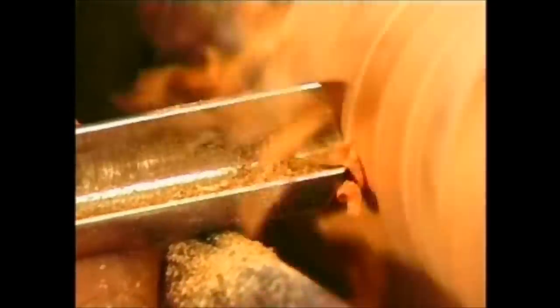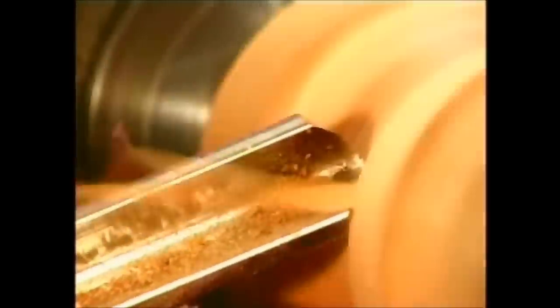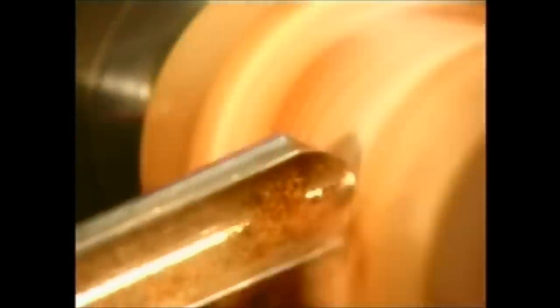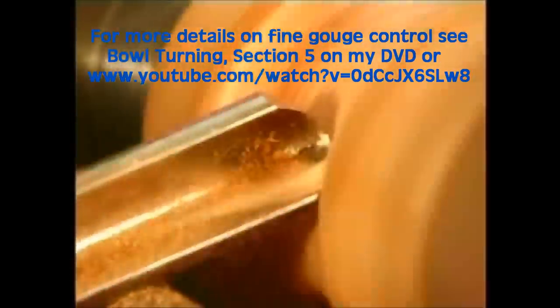In this close-up, you can see how, in front of the tool, the bevel is well clear of the wood, while behind the tool, the bevel is still rubbing. This gives control over the cut. Used like this the tool feels safer, but the smooth, easy cuts never happen. If you bring the tip up until the bevel is in line with the wood both in front and behind, the quality of the cut will improve vastly. It makes the cut smoother. The wood comes away with less effort. The finish from the tool is much better.